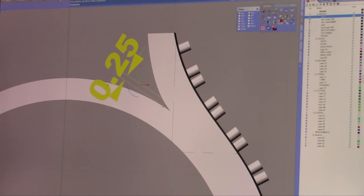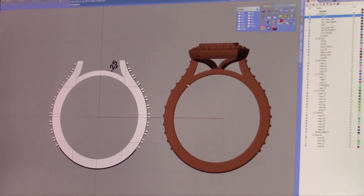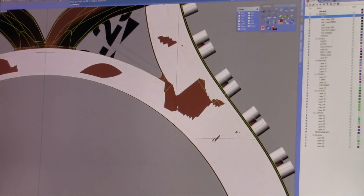The way to solve this problem quickly is to radius the inside, like we have here. You'll notice the difference as we bring it up — these are the same shank, however at this point I've radiused it, giving it a way not to fill in with that very thin piece of investment.